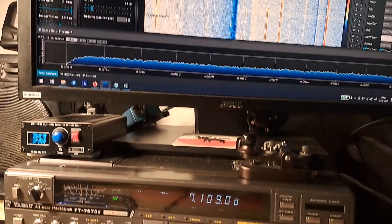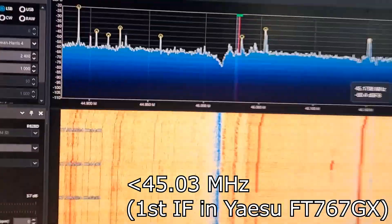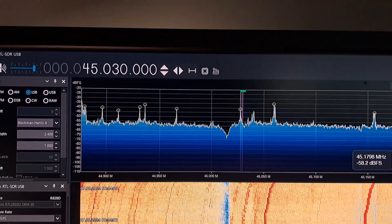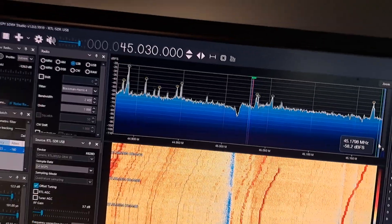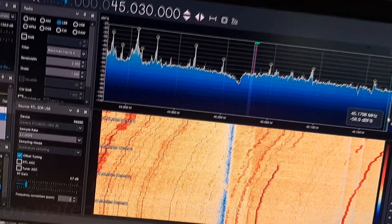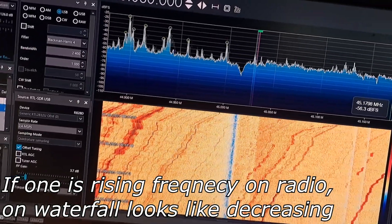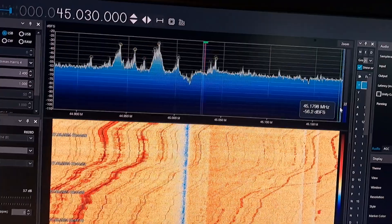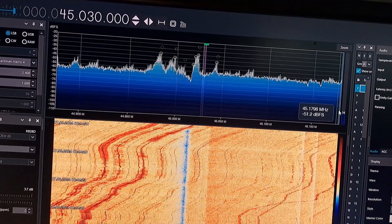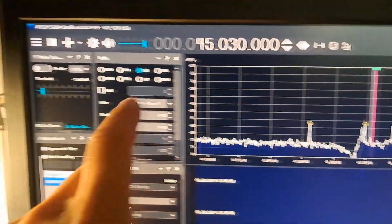Please note that my main radio frequency is lower than the first intermediate frequency. That means the first superheterodyne conversion is an up-conversion, not a down-conversion. When you raise the main radio frequency, it will look like a decreasing frequency on the waterfall, so it is opposite to the changing main frequency. Also, if you would like to monitor audio over the SDR apart from visual waterfall aspects, in this case when listening SSB, the LSB will appear as USB and USB will appear as LSB.